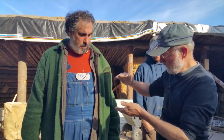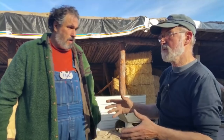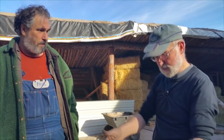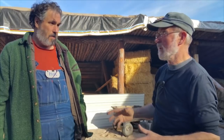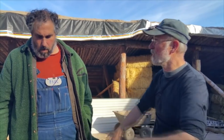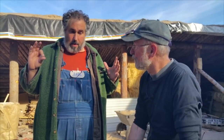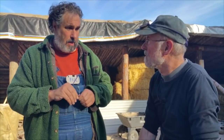The metal piece is that high, underneath there, there's the tunnel. I started with J-tube heaters this size, just steel, and the piece which burns out fastest was about two inches above the floor of the burn tunnel — the sides of the feed tube, low. The eight inch system that we did was a disaster. We figured part of it was because we had a steel tube in the wood feed, and it was also kind of like what you're doing here.